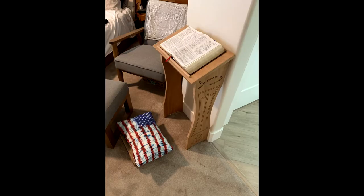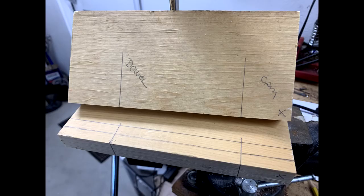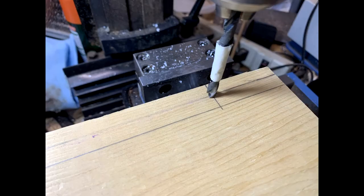Trial fit before I go any further. Almost all parts are fastened together with cam locks and quarter-inch wood dowels. Here I have used two pieces of scrap wood to demonstrate the method I used: typical placement of joining wood, scribing lines for drilling and mounting, then beginning the effort to drill matching holes for the dowels. I use masking tape wrapped around a drill bit as a poor man's depth gauge. Using my shade tree jig to drill a dowel hole on the edge of one part, then center-punching where the quarter-inch holes go on the mating part. I use my mill as a drill press whenever I could — it makes for a near-perfect 90-degree hole.